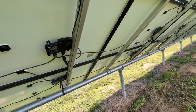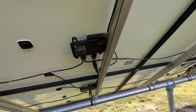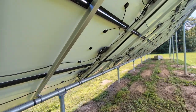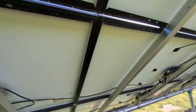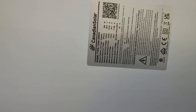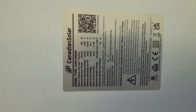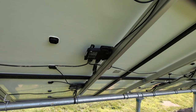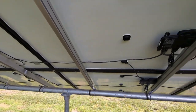The reason it's nine panels in this string is because the combined electricity they produce keeps us within the 20 amp breaker limit. Here is the type of panel - it's a Canadian Solar panel. It says maximum power 390, so these may be 390 watt bifacials. Every panel has a serial number or barcode, and so does every micro inverter - the software we're using will tell us all about that.